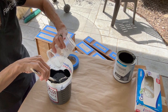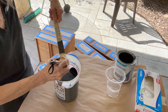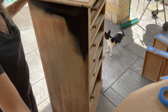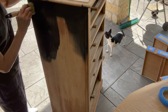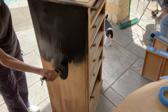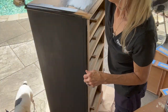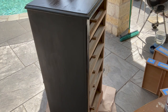I'm going to use a paintbrush made for chalk paint — I got that on Amazon. You can just brush the chalk paint any which way you want; it doesn't really have a rhyme or reason, just get full coverage. You don't want to put too much paint on there, but enough to cover it up. I ended up doing one layer, letting it dry, and then coming back with another layer. This kind of project really doesn't take that long — it's just the drying time between coats. If you get any runs, make sure you get those smoothed out before it dries, because chalk paint dries pretty fast.